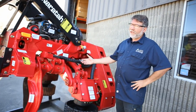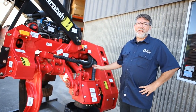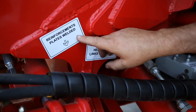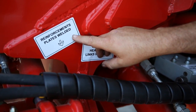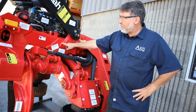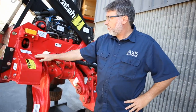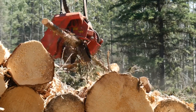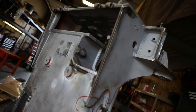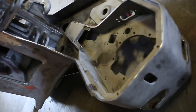What we do is we take the head and completely strip it down. We check it for cracks, and then the first thing we do is put reinforcement plates on all the typical wear items on the machine. You can see we have some here, some plating here, because we know where they crack. We see them after they've had fifteen thousand hours, so we know where they crack. Even if they're not cracked, they still get our reinforcing.